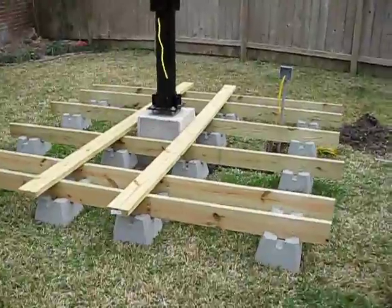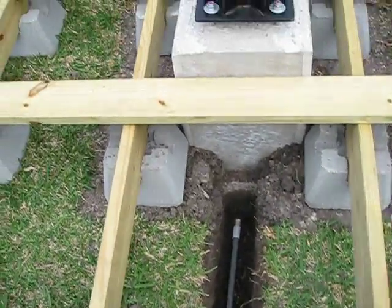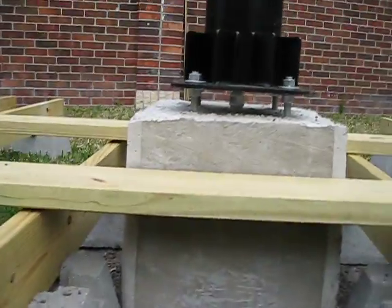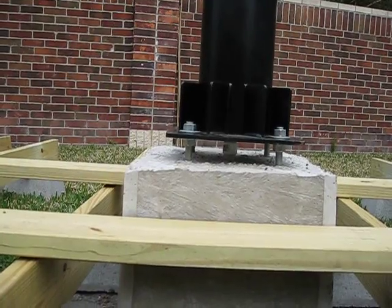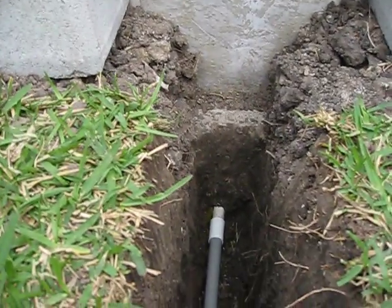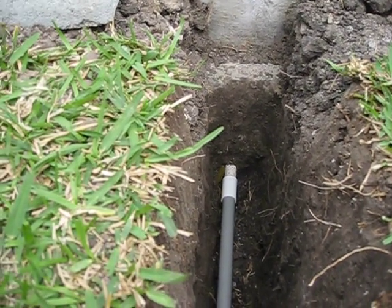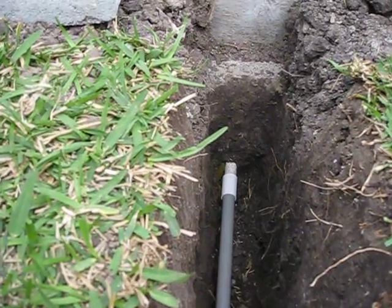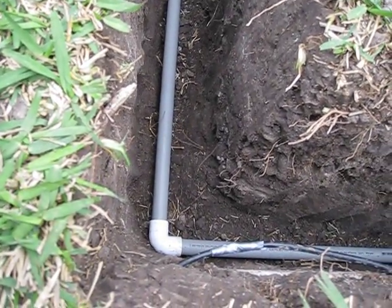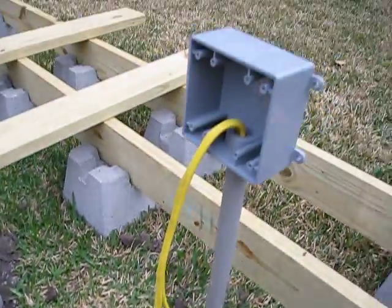What I've been digging — the trenches for the electrical conduit. Remember the conduit I had running up the middle of the pier? Well, there's the end of it, and it comes out there at the white bit. I had that sticking in some dirt when I filled the hole with concrete, found it again, dug back down, and today I've dug the trench — she's 18 inches deep as per regs — and I'm just about to PVC the connections in and run electrical wire up to the boxes.